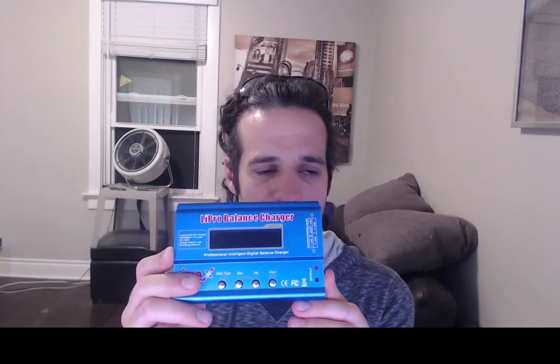In this one I can't actually calibrate the voltage — that's disabled. One thing I was able to do was hold these two buttons here while powering it up, and basically it shows you each of the six cells and their voltage. I didn't have anything connected at that time so they all showed zero, but I was able to get back into that menu. I'm waiting until all six cells are completed and then I'll hook it up and see if I can calibrate it.